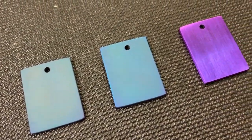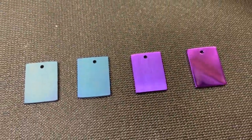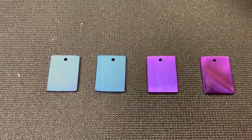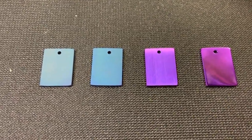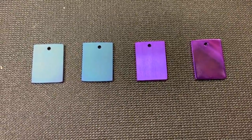This is a very good demonstration of why we never call out colors just in terms of voltage, because there's a lot of discrepancy that can happen at the same voltage. We're going to bump this up to about 95 volts now to get into the cyan greenish colors and see what happens.